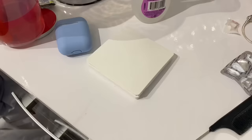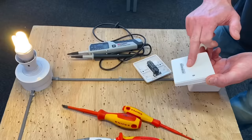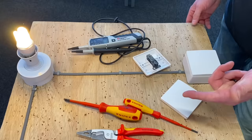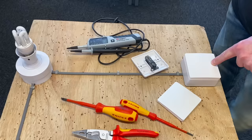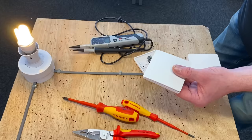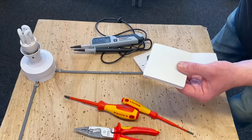I've introduced another switch — very similar in design. You could stick it or screw it to the wall; my daughter leaves hers loose on her bedside table so she can move it around. At the moment it's not paired, so it doesn't operate the light. To pair it, push and hold for about six seconds until it starts to flash — that's pairing mode. We take the switch we want to pair and operate it. It uses kinetic energy and now I'm turning that light on and off with both switches — it's become two-way switched.